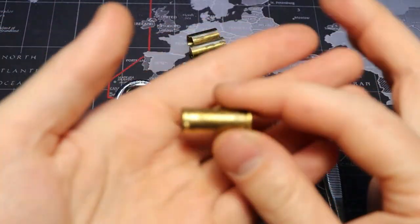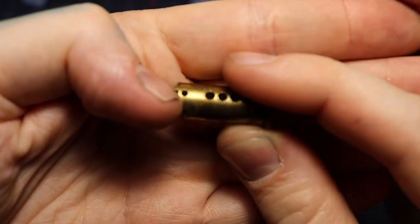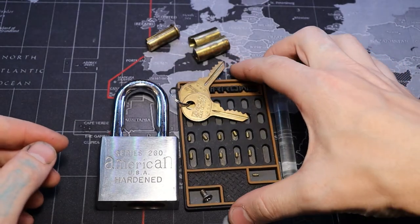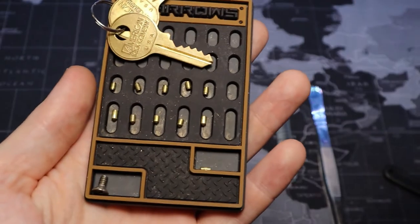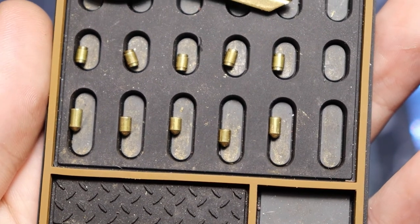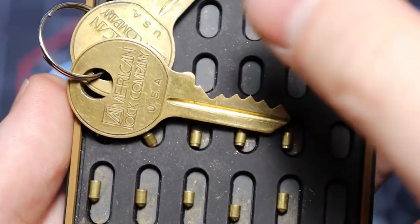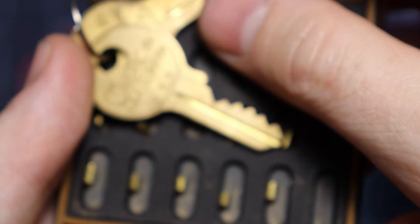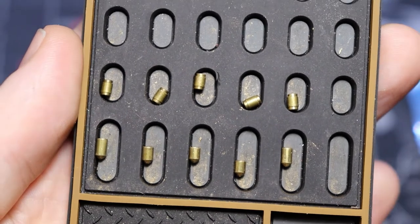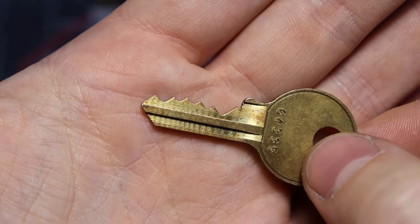We're back. That's exactly what I ended up doing — drilling out the side pin on the plug and just taking that top pin out right there. I was able to remove the plug that way and gut it. I'm glad I did, because these pins really surprised me. I'm used to American Locks having some serrations on the bottoms with their taller pins, but the top pins here seem to be a type of barrel pin with no lip on them — kind of tapered almost. Yeah, all the drivers are that way. Very cool. And here's our bitting — some really good bitting there.